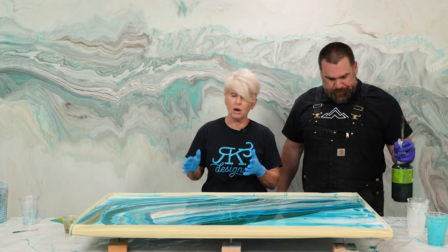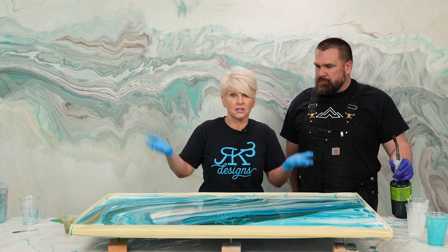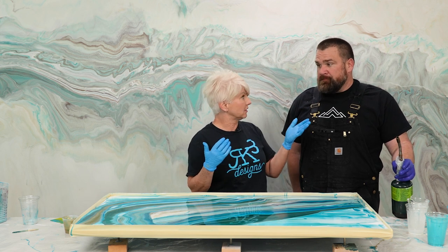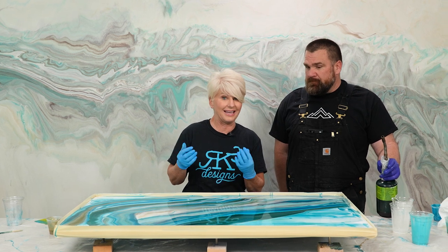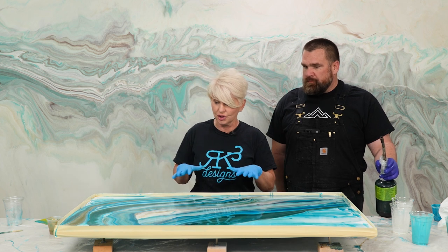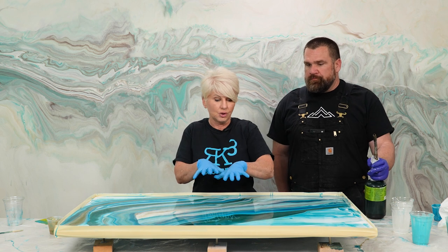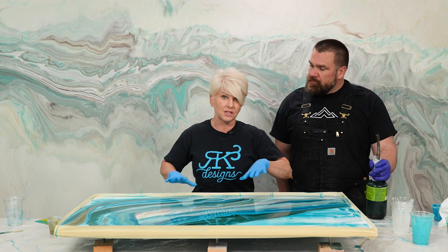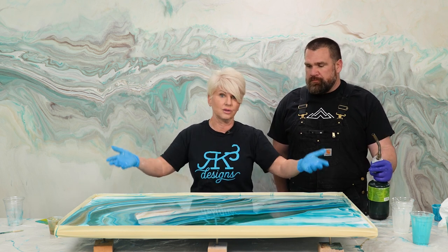So normally on an on-site pour where we can't tilt and help the epoxy move, personally, and you may be a little different, we start our dirty pour recipes at 8 ounces per square foot. The reason we do that is because that ensures we have plenty of product on the surface to help itself level. And again, that's why we tape our edges, so that as it starts to self level, all of that epoxy doesn't run over the edge.